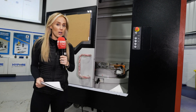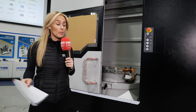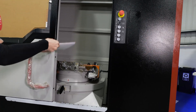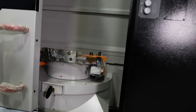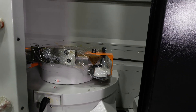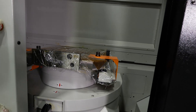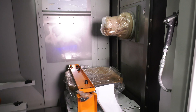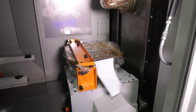It's the horizontal side of this technology that I want to talk about. Here you've got a twin pallet system, so your machine is being loaded whilst it's cutting, and that is going to improve your uptime. Uptime is everything if you're looking to increase your productivity — it means that spindle is running and you're making money, if you can consistently feed it.